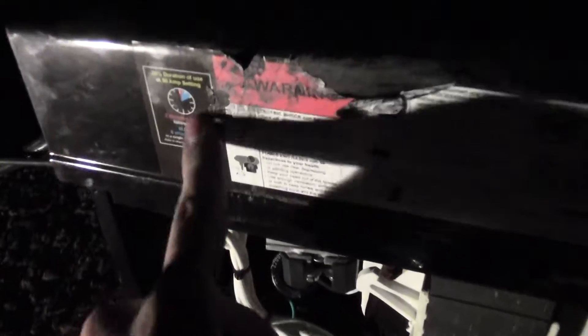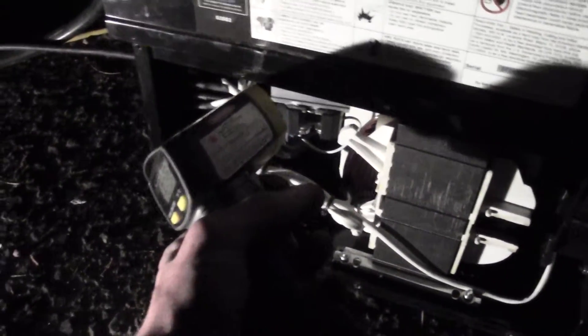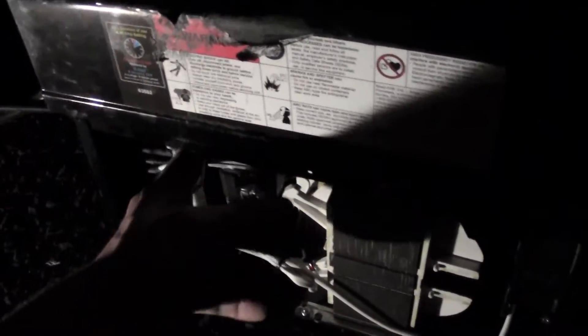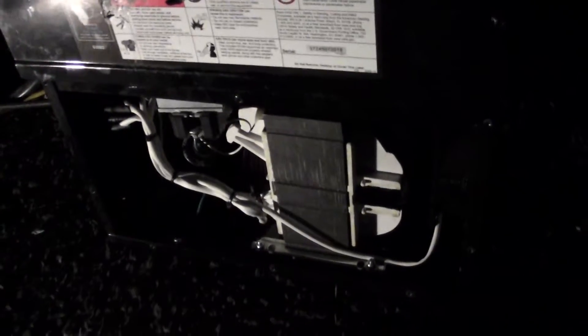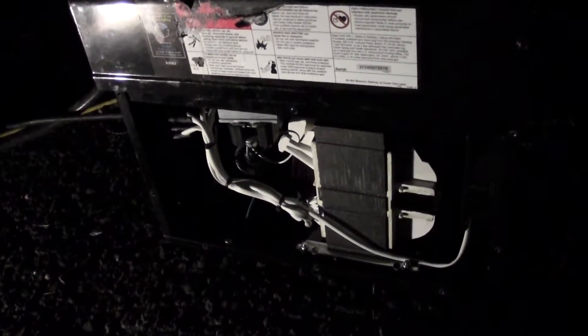I've been doing some welding on the truck. According to the instructions you're supposed to weld two minutes on, eight minutes off — I've been doing about eight to ten minutes on, three to five minutes off. This rectifier has never gotten above about 115 degrees. It cools off super fast. I think around 115 degrees the temperature differential between the air and the rectifier becomes great enough that it's able to self-sustain and cool, so I don't think it'll get much above 115. The transformer is actually pretty toasty though, so taking breaks is good. The capacitor is just slightly warm to the touch — not hot — which is interesting given how much current is going through it.